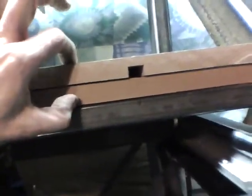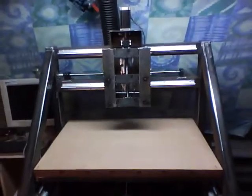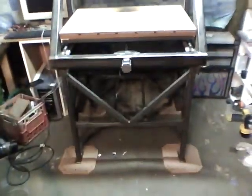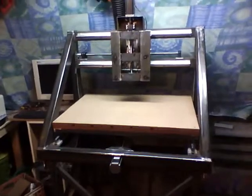The second layer will get glued and clamped to the first — glue only, no metal fasteners — so I can hit this table with a bit and not worry about hitting fasteners. Once it's glued together I can grab my router and finish up these slots into T-tracks for my hardware. And if I ever need to remove this, I can go through here with a drill bit and pull the screws out of each slot. There is my table — so nice. A lot of weld, a lot of steel, a lot of weight.